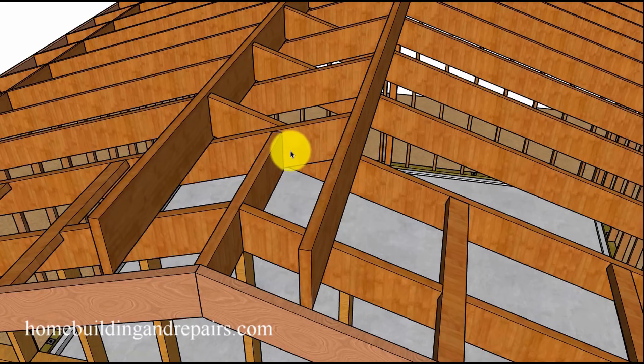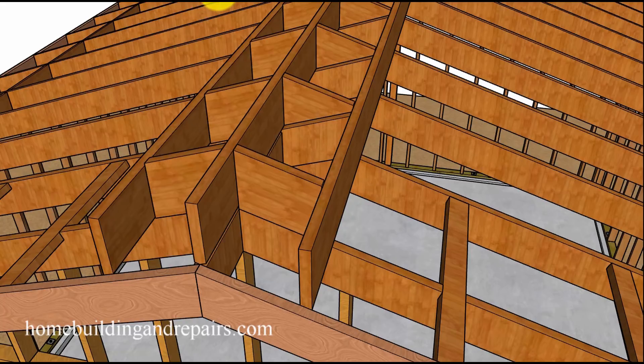In the picture those were 2x4s, so here you could actually put a couple more bolts. The pressure from this rafter wanting to go down would be stopped by the other rafter, and the same on the other side. So I think this could be a strong roof.